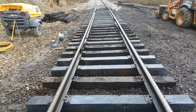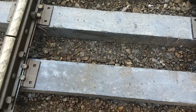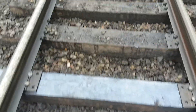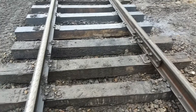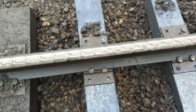Got all that cribbed out up to the new rock and got down there where I started this morning digging. I put a bunch of new ties in here yesterday — these new ties really look nice in the track bed. This is called a skeleton track. I go through here and my job is to crib out ties and help change the ties with my excavator. Do the cribbing out and then come back and have some laborers help me. They'll pull the spikes on the old ties and I'll get underneath the rail with my excavator bucket, pick the rail up so they can pull the tie plates out. Those are the tie plates there.